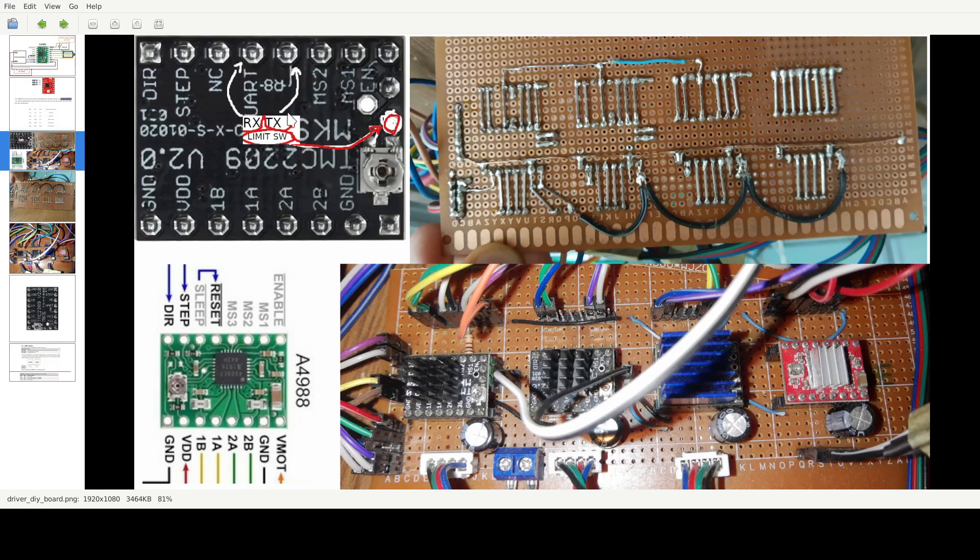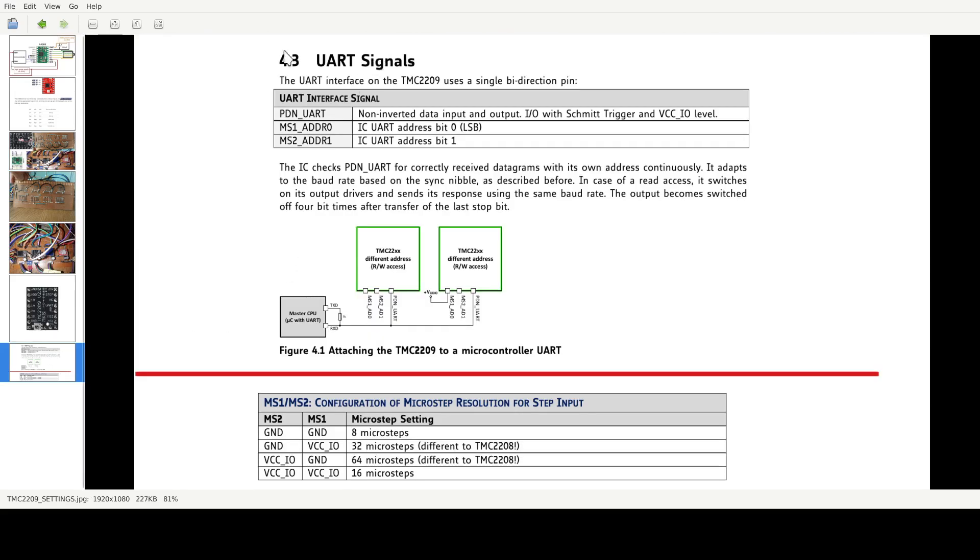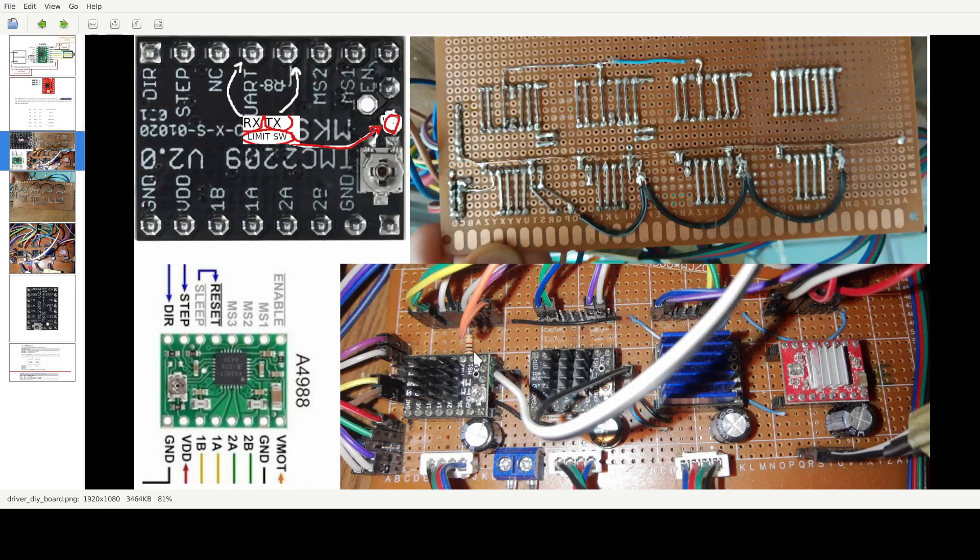So the first three — up to the third one — are not connected. The next one is the serial UART connection. I'm connecting it to every one of the drivers. This is the receive line. Then you have a transmit line going to a 1k resistor. You can see it here — brown, black, red, and gold — that's a 1k resistor connected between these points.